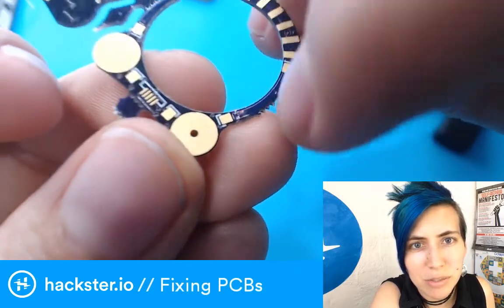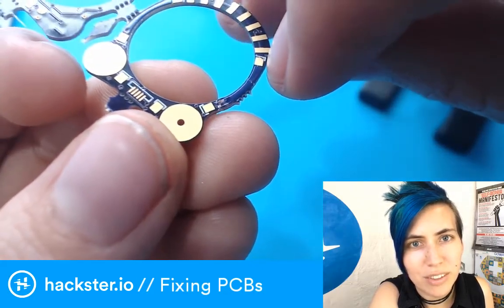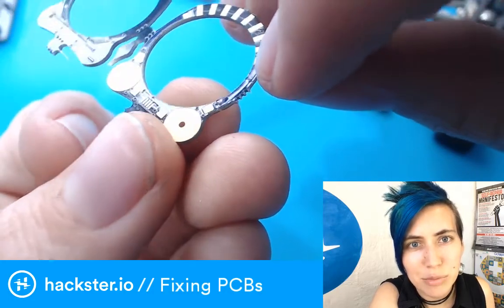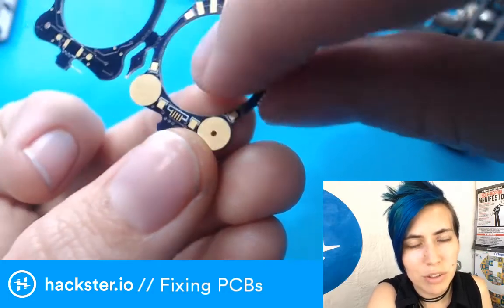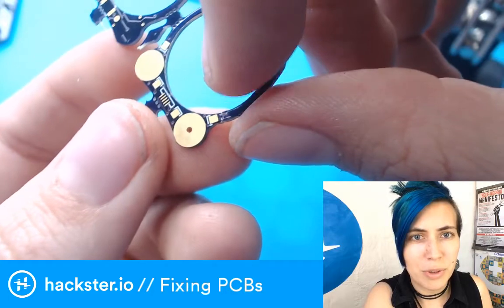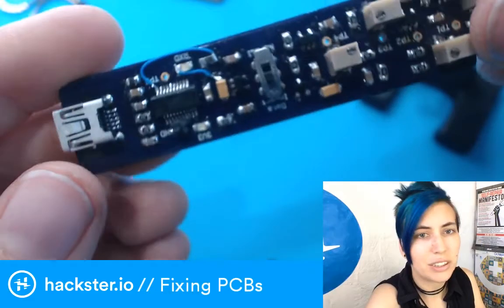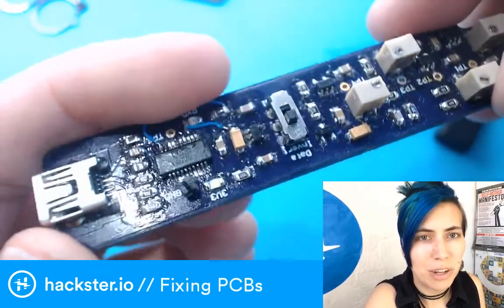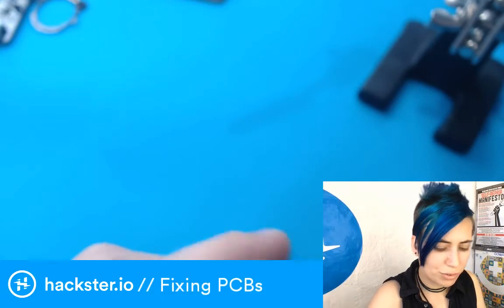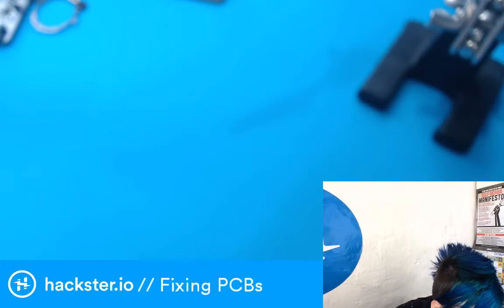So I figured that this would be the best place to repair it. I thought about trying to run a wire from the pin, skipping that whole thing, over to here maybe. But that seems like it would be the wrong approach. Also, I don't have any actual magnet wire that would be insulated. So if I ran it all the way along here, then I'd run the risk of shorting it out with something else. Like you see over here, you've got insulated wire, and the one that Piotr used was for most of it magnet wire, so that had enamel on it. I'm going to keep doing this, just off screen, so I can get it done fast.